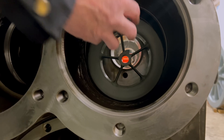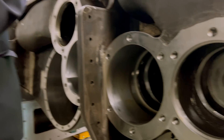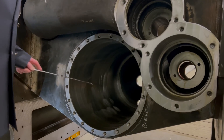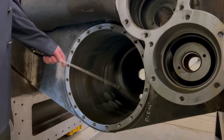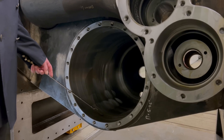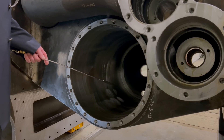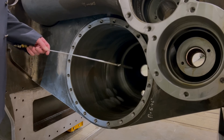The valve itself will have a spring on the outside here between it and the cover to keep it shut. And there will be a spindle in the hole here which extends through a seal and another valve seat into the middle area of the cylinder block. One thing we have to do with this cylinder block, because it is made of steel, is to insert cast-iron liners into the cylinder to provide adequate smooth lubrication for the pistons. This cast-iron is a special mix that used to be known as cylinder metal and includes a certain amount of phosphorus in it, which provides considerable toughness to wear — obviously essential in something which has got a piston rubbing up and down in it all the time. The liner has ports machined into it to correspond to the ports which take the steam to and from the valves.